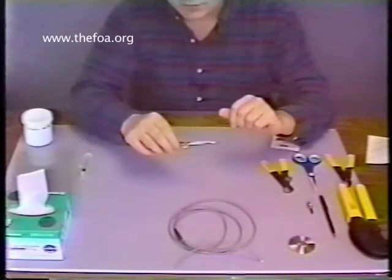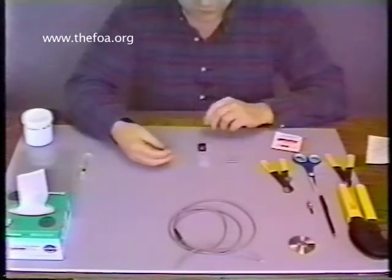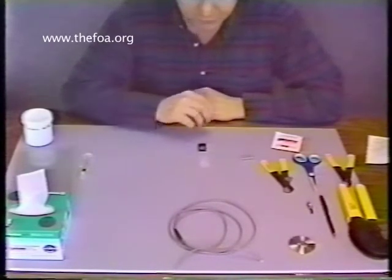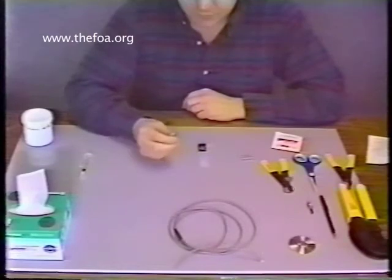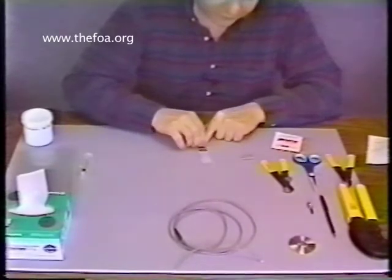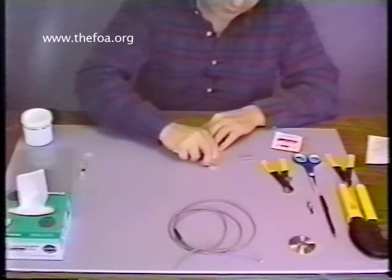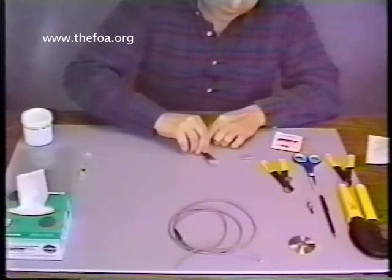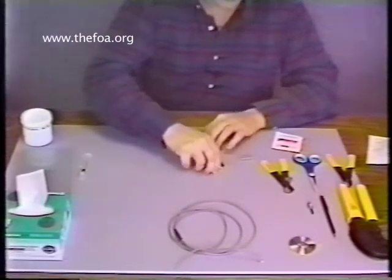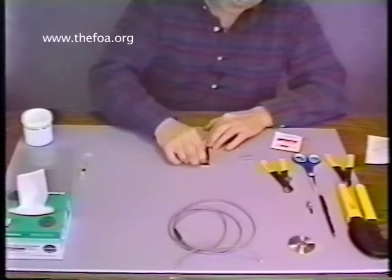The mixing process is fairly simple. We take apart the divider, lay that on a flat surface, and depending on which side is more comfortable to you, we take the two halves and start kneading the epoxy back and forth. There are some specific tools out there people do sell for this job, but the easiest way is to take these sharp edges and start kneading the epoxy back and forth together. I'm doing it inside the package — I'm not removing the epoxy from the package — so it is a neat process. I'm turning the epoxy around, making sure the two parts do come together.